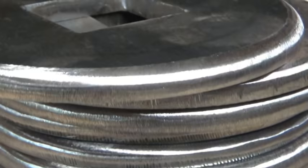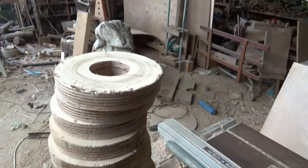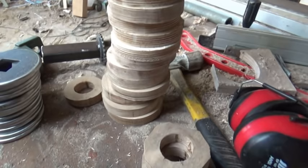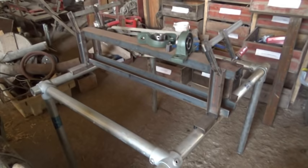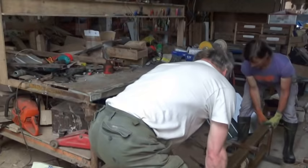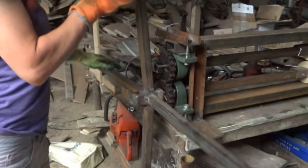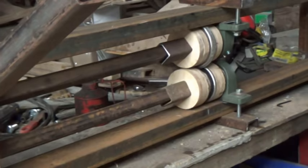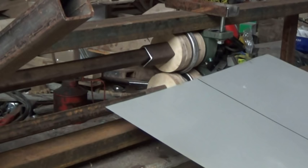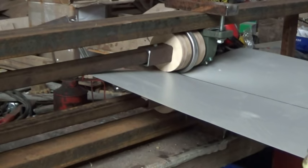I could not have made this machine without my wonderful CNC plasma cutter — every home needs one, link in the description. I took the opportunity to upgrade to bigger dies and a bigger shaft for extra strength. Though I started building a frame wide enough for a half-width sheet of steel, I decided to go all the way and allow for the possibility of one day going wider — frames with a capacity of four feet. I made a pair of dies bigger than before to accommodate the bigger shaft, placed them in the middle of the frame, connecting the shafts together with homemade cogs. And my machine was begun.